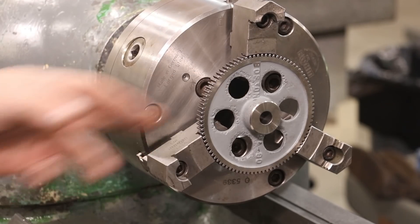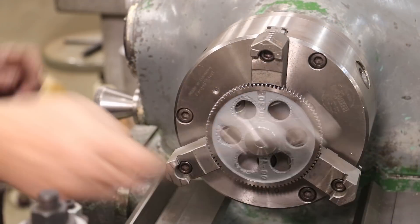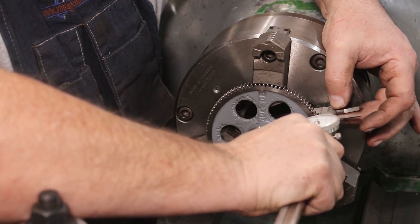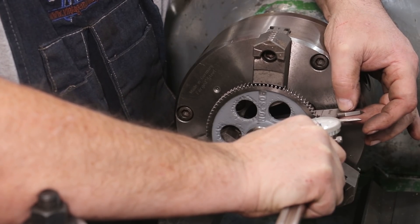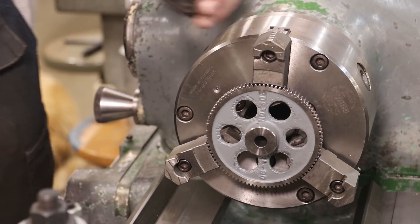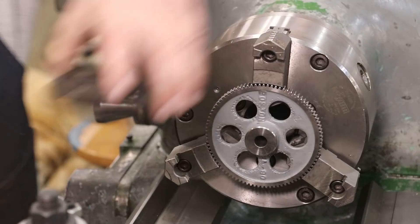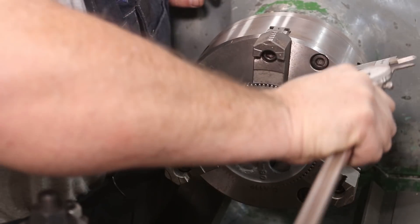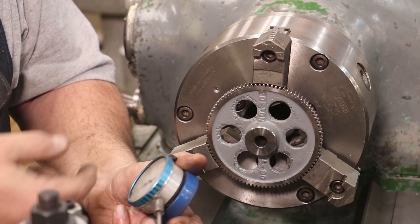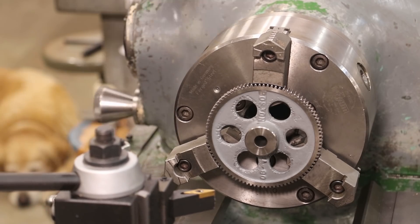What I need to do now is make this a little bit thinner. Let me get some measurements and figure out what we need to go down to. I've got my 12-inch calipers out — my 6-inch calipers won't quite reach. We're at about 866 thou — 875 would be 7/8ths, so that looks like what they were shooting for. We want it down to about 450 thou. I'm using my little poor man's DRO here — a dial indicator with a magnet stuck to the carriage so I can measure how far in I'm coming with the cutter as we're cutting.